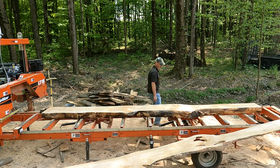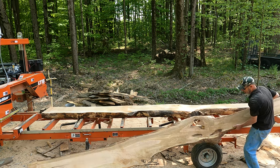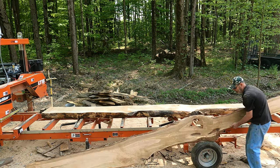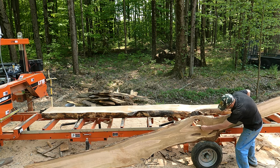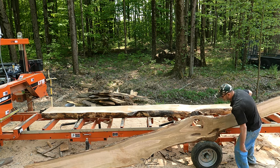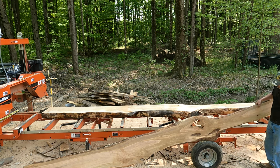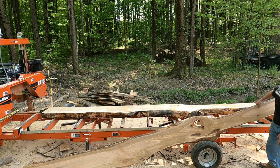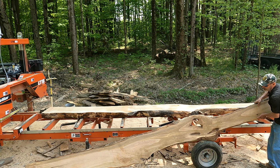You can see the hole there. This is what I'm talking about. That big old hole. I can't have that in the middle of the beam, and it looks like it comes all the way out to here. So I think this is a losing proposition. I don't think I can get a beam out of that. I could get a short one, but I may as well just make boards.